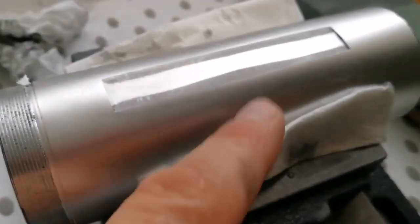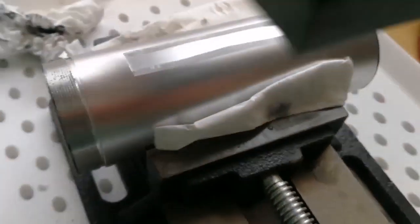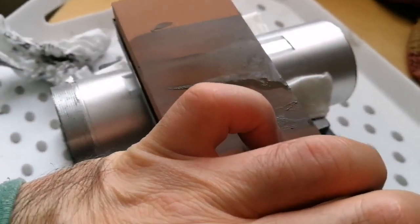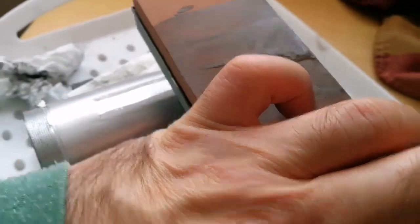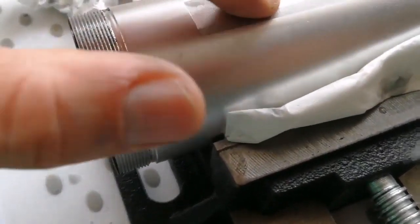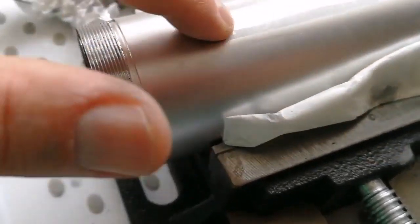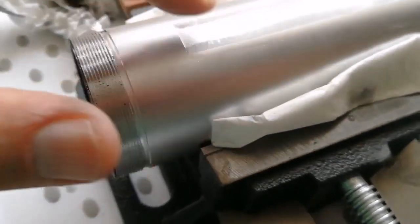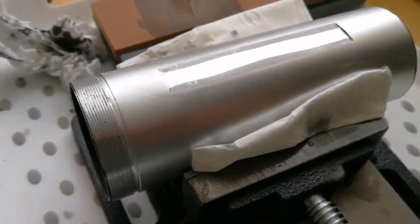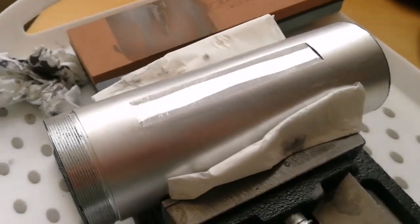This middle part has got a little bit more abrasion, because when I'm using this water stone from this side, the middle part also gets some abrasion, and from this side it also gets some material removed. So the center has lost a little bit more material here. But I feel that is a surface that I like to have. I will try it. If it works and can hold the eyepiece and moves smoothly, what's wrong with that? That's good. I will go with this.